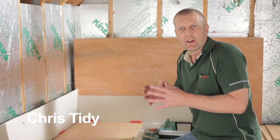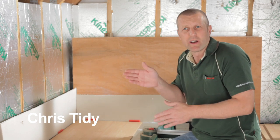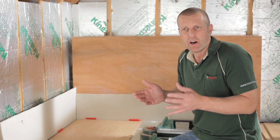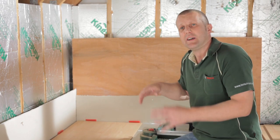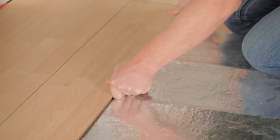Yeah, so what I've done is I'm up against the wall, and the first thing to think about is you want to break the joint. So you don't want the joints in one long straight line. So what we do is we cut quite a few boards in half. That way we're staggering the joints. So you've got one full board, one half board, one full board, one half board. So then obviously when you get the next lot in, that's going to be a half, then a full, and if you get what I mean, you're just staggering that joint all the time.